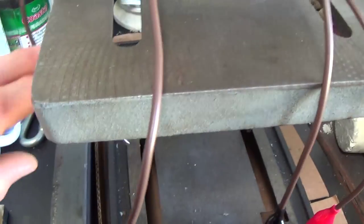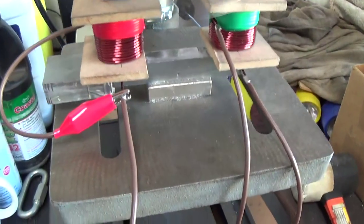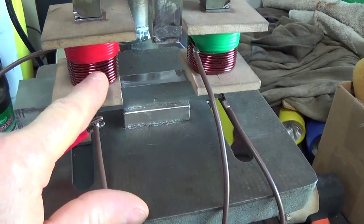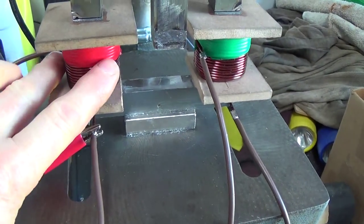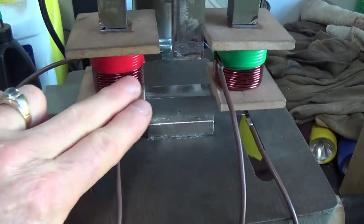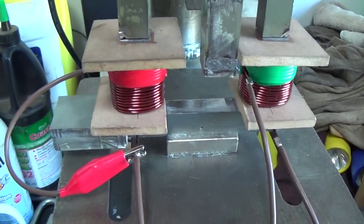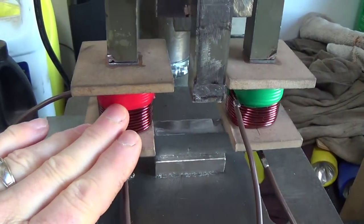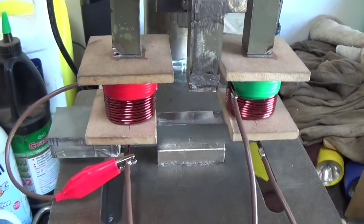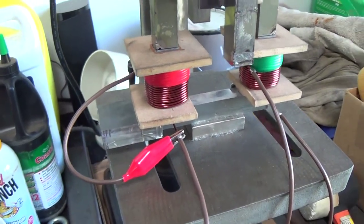The coil does help a little. So the next thing I'm going to do is unwind this coil and put more protective material — I had some protective tape at the back to keep the windings from shorting out on the core, and I'll have to add more of that. I'll rewind it, make sure it's not shorted to the core, and I'll do more tests to see what that effect is about. Thanks for watching, bye now.